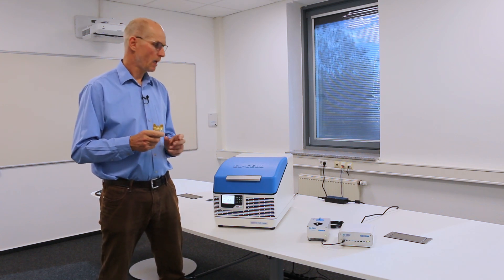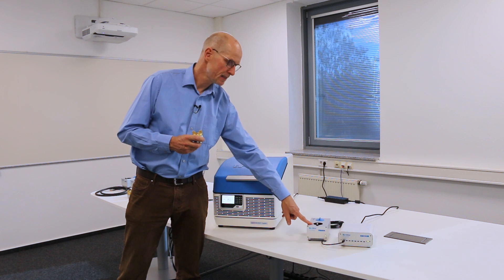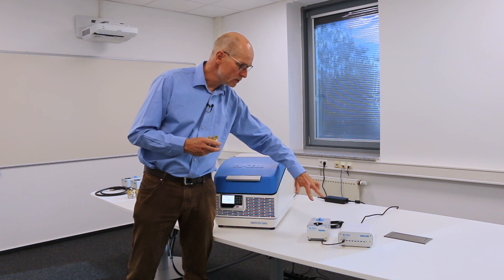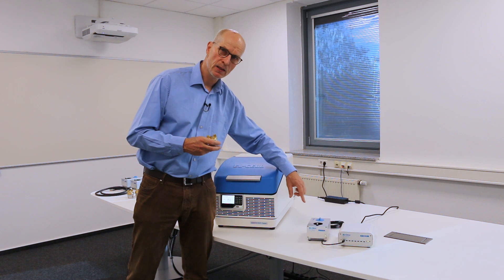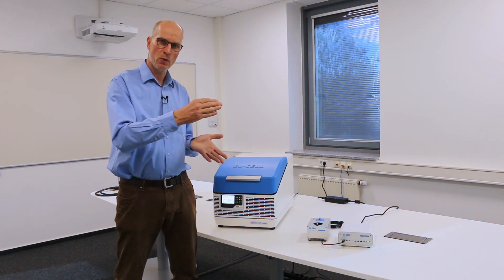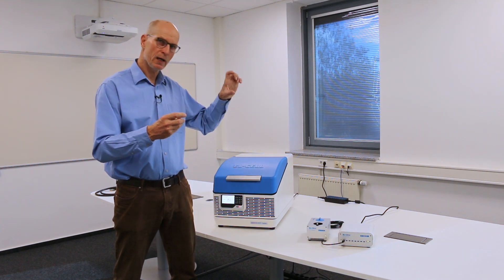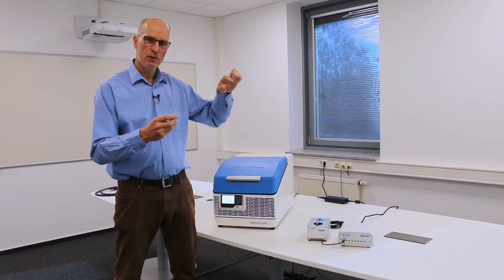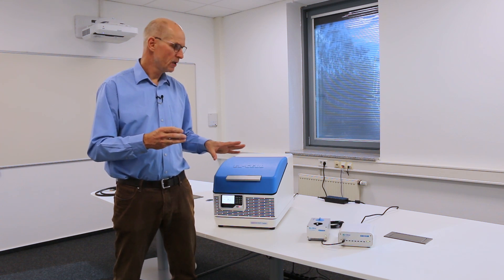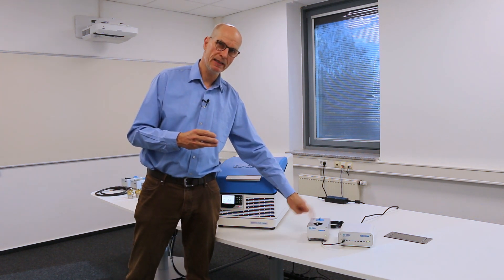A very special feature of this channel is what we call a connection matrix. This means you can connect the three terminals of the potentiostat — working, counter, and reference — in various ways with the three electrodes of your test cell. In that way, you can control either the full cell voltage, one of the two half-cell voltages, or even the current between one of the two big electrodes and the ring-shaped reference electrodes. All this is done by software control — no need to plug any cable. All the switching is done inside the channel board.